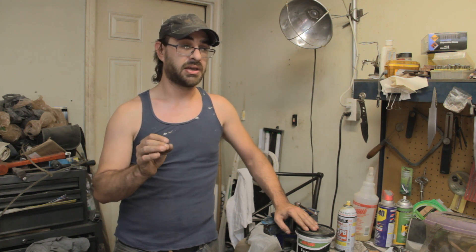For today's video, however, I will go ahead and show you how I clay a blade. It's not a very lengthy process, but first and foremost, let's get some ground rules set up. First and foremost, it's hamon, not hamon, not hymen. Hamon are, of course, how the Japanese, and actually the Chinese before them, differentially hardened blades — not for spring temper, but for the sake of trying to avoid cracking blades when you're working with home-brewed steels. Today's modern steels don't have that kind of problem, and so the aesthetic qualities of the hamon produced on katana are still the traditional aspects that we see with today's hamons here in America, Europe, and so on.